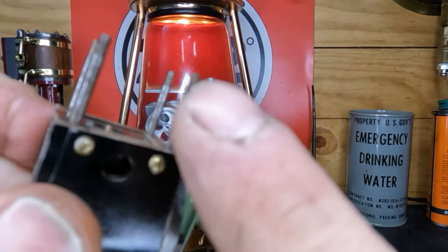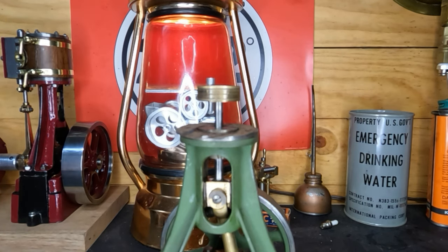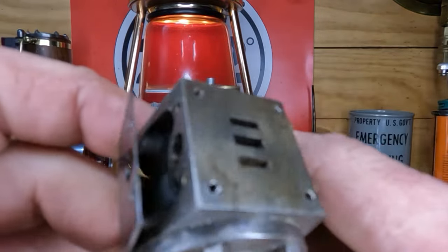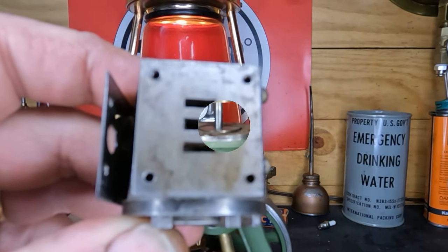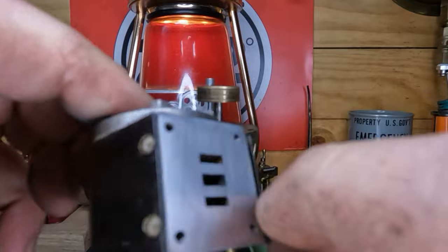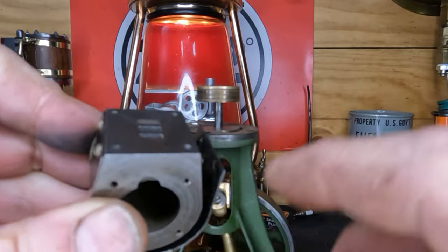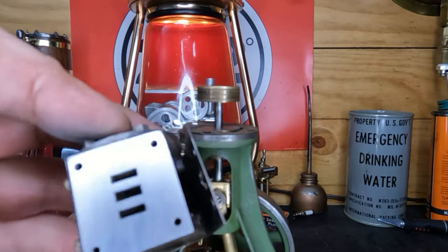Let me get the studs out of our cylinder assembly. We will face this - we'll face our valve block right here. We'll put it back together and see what we've got. Here's a quick look at it before. Let me get this done and you guys can see it after. Okay, here's after - these are just marks, I've still got to blow it out. If you do any work on these, make sure you blow out your ports because any residue can get down through here and wreck the inside. That looks like it's going to be just fine now.